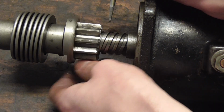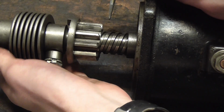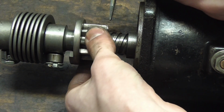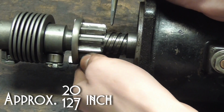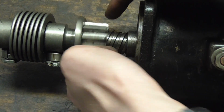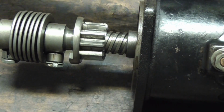And now suppose that the starter stopped in the least convenient spot, like this, where the weight would force it to fall down. It would fall until here, and you've still got 4 millimeters of space here. So let's just pretend Ford knew what they were doing here and figured out that even with this sitting somewhere down here, it won't crash.